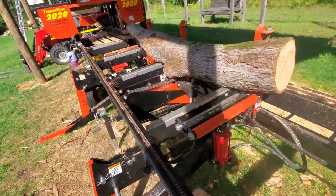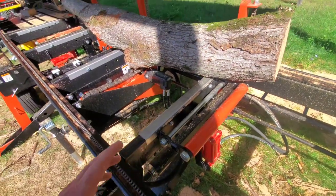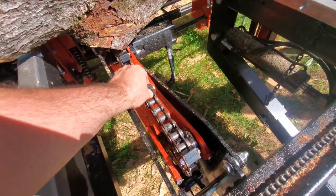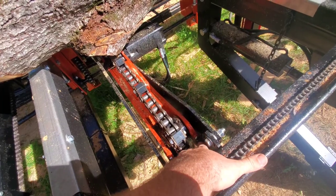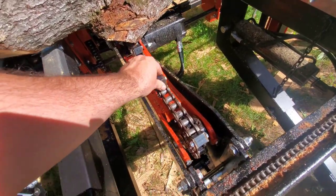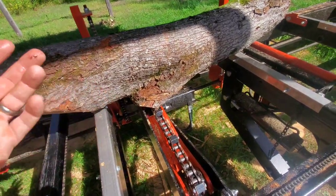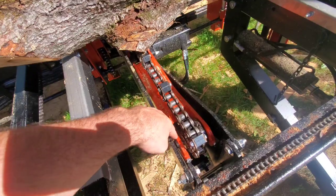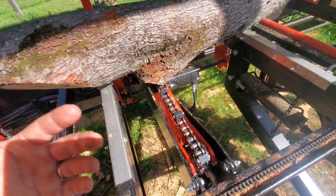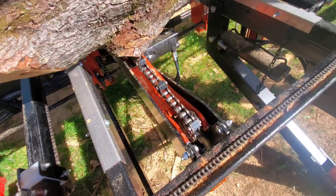Anything new with metal-on-metal contact — like the turners — spray a little ATF in there. The log turner chain was tight and I'm going to loosen it up using the two bolts that slide the pin assembly up or down. When I first used the log turner I kept feeling a weird vibration and hearing a loud ticking. It turned out the sprocket was turning on the pin with no lubrication between them — metal on metal, actual grinding. I applied ATF and will loosen that chain.